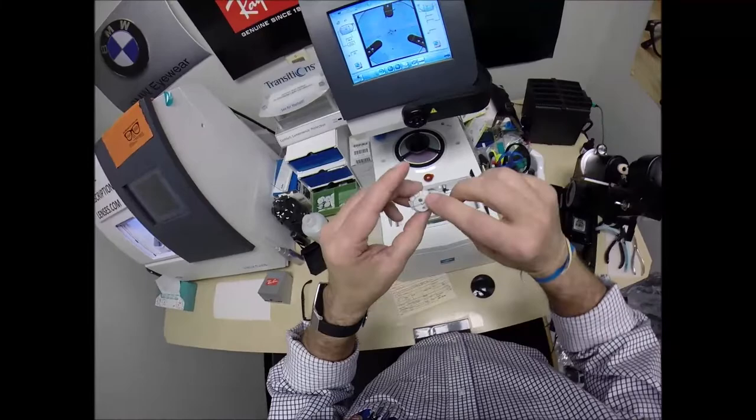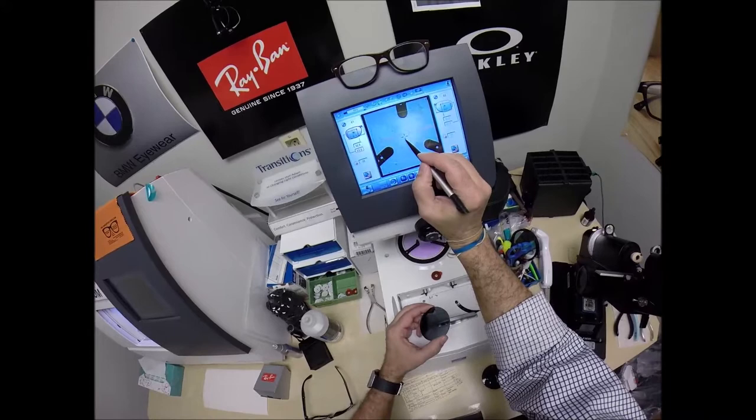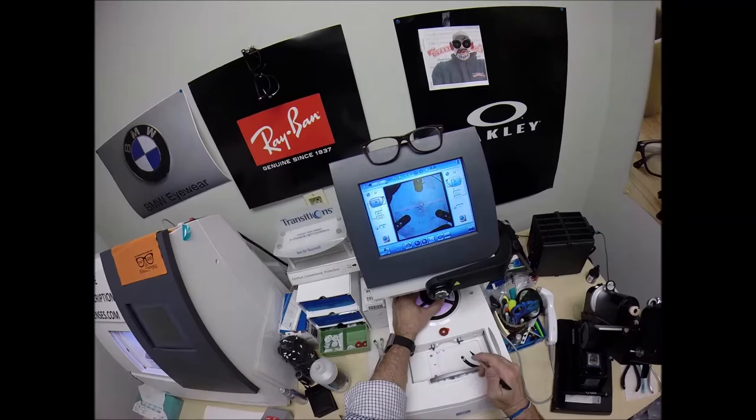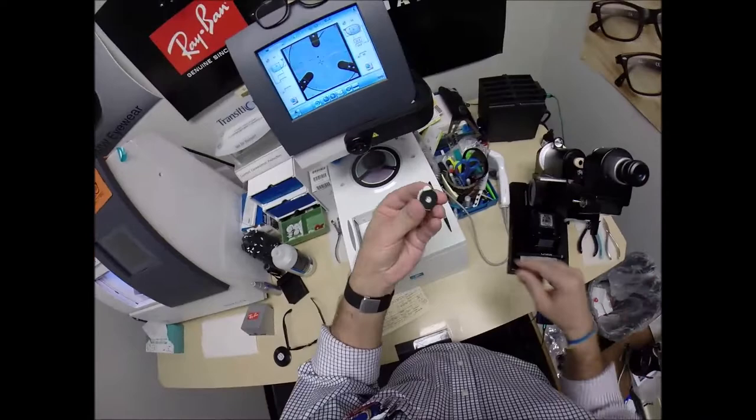I put the sticker on there, pulled the paper away to make the black side sticky. On the back is a silver button — that is a magnet. It's going to do its job twice: the first time it's going to attach itself to another magnet in the arm. The blue cross is the geometric center of your frame; your eye is just above that and inset inside that orange crosshair. Everything lined up, hit this button — the arm is going to come down and place the block onto the right lens.